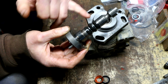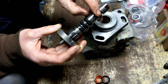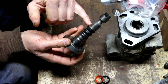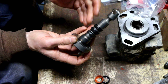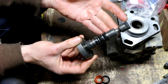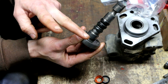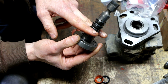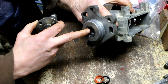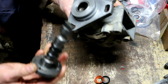Also, on the plastic tube one, I found on a website that was selling that part that they said on the models where the shaft has a snap ring that goes here, which mine does, because remember this inserts this way and then the snap ring goes in down there, it's not for use on those. So apparently this isn't even supposed to be the style that can use this plastic tube thing, which is great because the stupid plastic tube thing was ridiculously expensive for a plastic tube. It was silly money. And then the other thing is almost like a clamp with a cup shape to it that allows you to squeeze this and then install it. But that's problematic too because you've got this bearing out here before you even get to where it goes in, and there's actually a bevel in there, so that's not the problem.